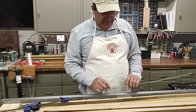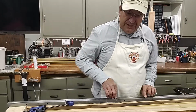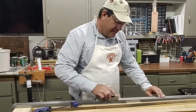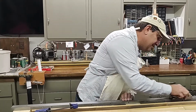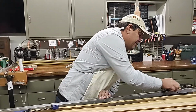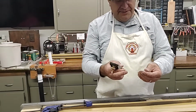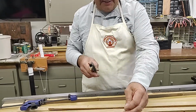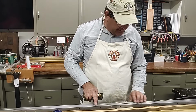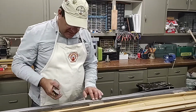And then you would take your strip after it was rough planed and tempered, and you would put it in here, and I would use a rod maker's plane iron in order to shape it. And I would just go along like this, and I would shave bamboo off of it. And a well-tuned plane will make these nice shavings at about 2/1000ths of an inch. Okay? And you would plane both sides of these and walk that up until it was even with this channel. It's sort of like making an inlay.